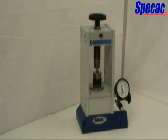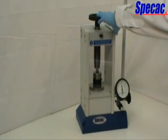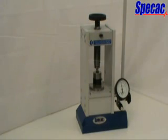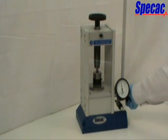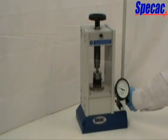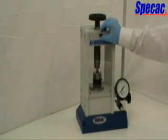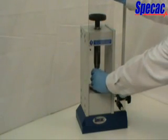You may observe a slight decrease in the tonnage load applied, indicated at the load gauge, with a decrease in the oil pressure of the system, as the work being pressed may relax over time. You can bring the oil pressure back up to give a required tonnage load by pulling gently on the pump handle grip further. To release the load on the work, turn the pressure release handle anti-clockwise by about 1/2 of a complete rotation. There is no need to turn this handle completely open. When the tonnage load has been released from the work, it is safe to open the front safety guard and gain access to the work that has been pressed.